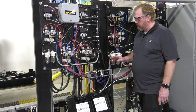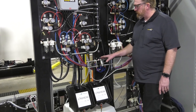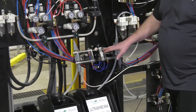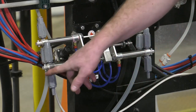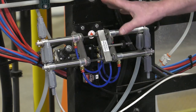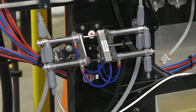One of the other critical visual inspections is on the chemical distribution system itself. We have a series of air cylinders here that drive the product out to the brush. It's really important to make sure that there are no air bubbles that develop in the uptake tube or in the discharge lines. If there are, they need to be cleared all the way out to the brush itself.